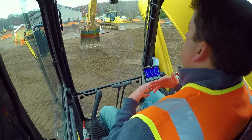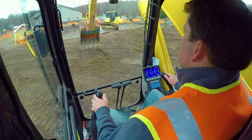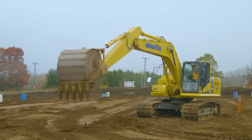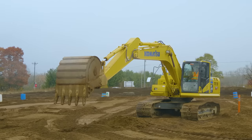Number three we're going to talk about is trenching. We don't have a separate trenching video, but there have been a lot of comments on our videos about this. We teach very entry-level operators basic controls, so we don't necessarily teach proper trenching technique. There are a few things I want to cover about what not to do when trenching. First and foremost, you generally do not want to start with your stick fully extended and teeth 90 degrees out. You don't want to just take one big bite out of the ground — generally when trenching, you want to go in layers, taking six to twelve inches off at a time.